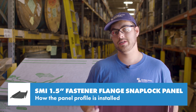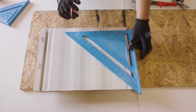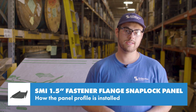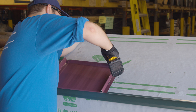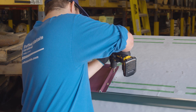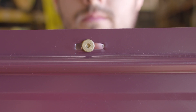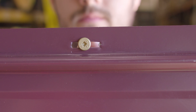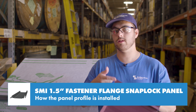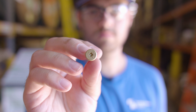Make sure to follow any installation guidelines or requirements available. I've already fabricated these panels with a 1-inch bend at the eave and a 1-inch box at the top — if you want to learn how to do it yourself, there are links in the description below. On the deck, the panel hooks onto the eave, is pinned on the box end with a couple fasteners, and uses fasteners installed into slots on the male leg. Make sure the fasteners are installed in the middle of the slot to allow the most expansion and contraction possible. Remember, you're relying on the head of the fastener to hold down the panel, so consider using a regular pancake head screw as opposed to an ultra-low profile pancake head screw to get the most contact.